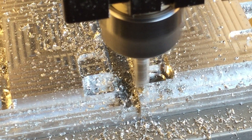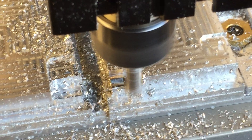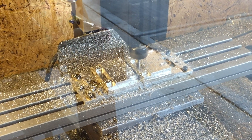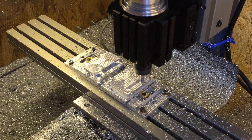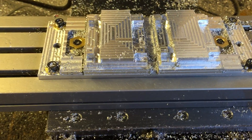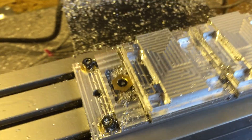Cutting all of this from a much larger piece of stock produces a lot of chips. It's usually good to have plenty of coolant to ensure that the end mills' long-lasting life and rigidity are maintained. This is before we cleaned it up a bit — notice the chips stuck near the clamps, but they did their job.